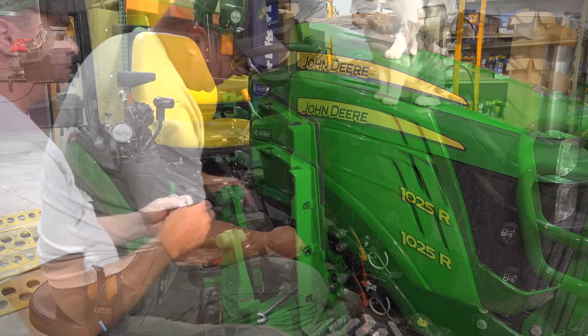The orifice is for the lift extend. I suppose if I didn't put it on, it would lift faster, but I don't want it lifting faster — especially when I have the forks on. I really want it to move slower and more steady, and I'm sure that's exactly what they've got in mind. This is not new with the single point — I'm sure there's an orifice on the existing loader hose. Sure enough, the blue hose has an orifice just like the other one.